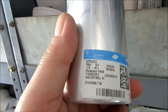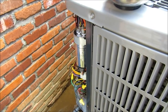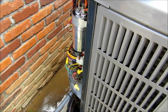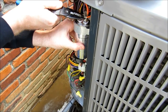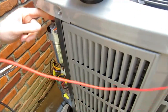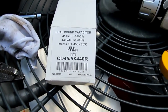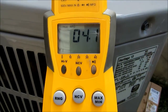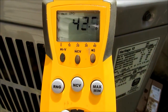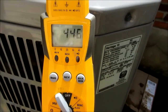We're going to find our 45/5 capacitor - we actually stocked back up and we've got one right here. Let's go pop this puppy on Brenda's unit and fire it up and test it out. I always preach to test your brand new capacitors even before you put them on. Pull your fan off and pull your two herms off - it's always good to use your pliers when you're doing it. You can leave the commons attached. What are you going to test first Ray? I'm going to test the fan first. Our brand new one is a 45/5, 440V, exactly like what we just took off. I'm on the fan - we've got 5.1, we're good on the fan brother. We're running 44.6 on the HERM - we're great. Let's go ahead and button that up.